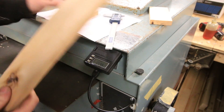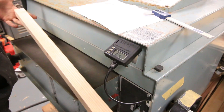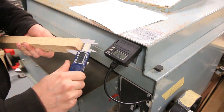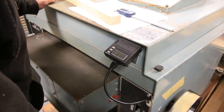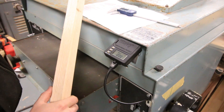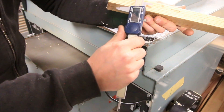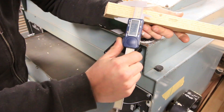Let's test it on what's left of this — run it through a couple of times and see what the planer DRO reads. I'm actually going to test it out on this piece of ash. Right now it's measuring on the calipers at 1.104 inches. Let's bring it down to exactly one inch. My DRO is reading exactly one inch — this should have no problem taking that cut. Pretty good to me — nine-nine-nine-five. That is awesome.